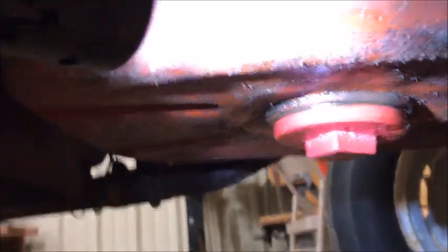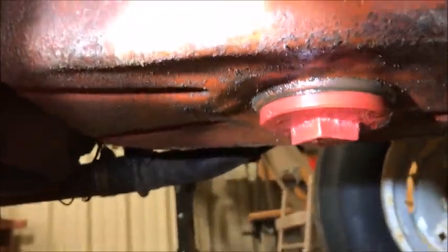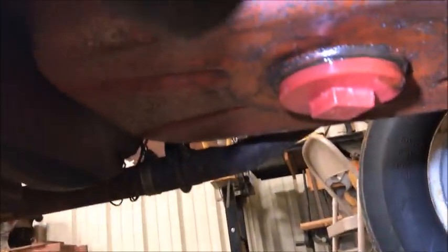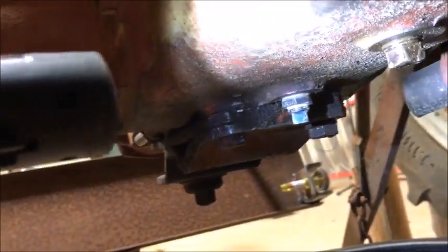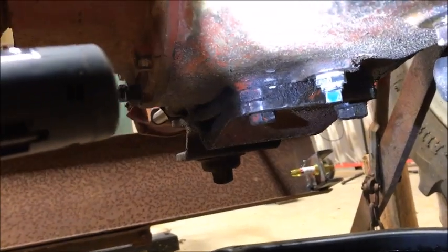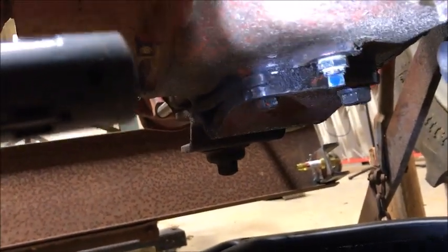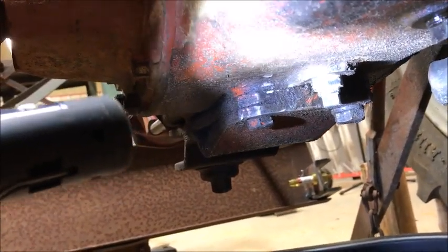Right, looking forward up here under the motor oil, the oil pan is here, and that is a drain plug and a gasket, and it looks like it's leaking a little bit. I probably need to tighten it. The one that was kind of messed up, you can see that one right there. Had to be a little creative. I got a plug with a lot of threads on it. So it's actually an adapter with a 3/8 plug in it.